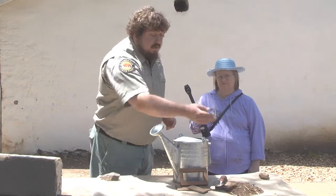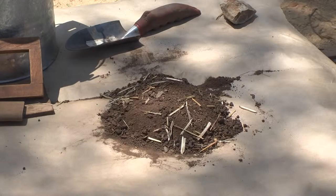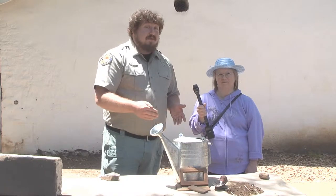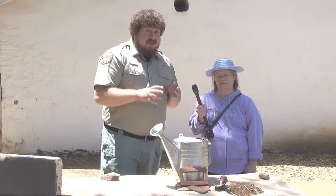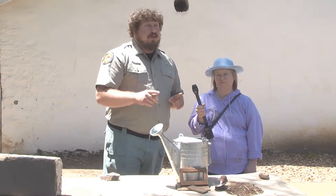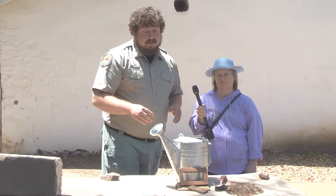To do that, we've got some dirt dug up from right here on the Rancho, and a little bit of dried hay, a little dried grass in there that's going to help the bricks set right when they dry. And then we've got a little bit of water here to get the mud consistency just right. Now a lot of people back in the day actually would use animal manure, cow manure, in the bricks as an additional binding agent. But we're not going to do that because we actually have really good soil here at the Rancho.